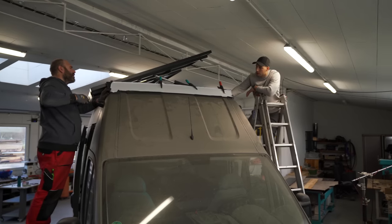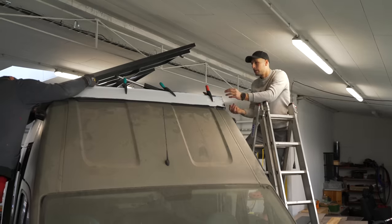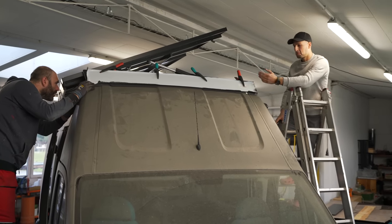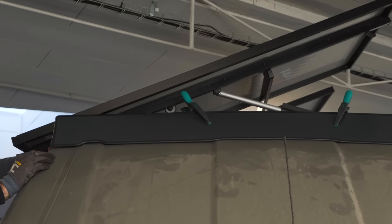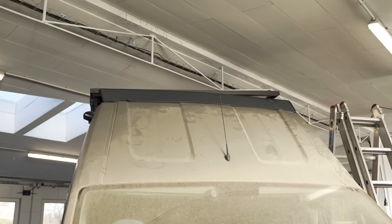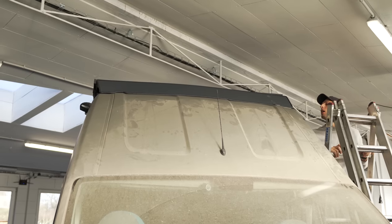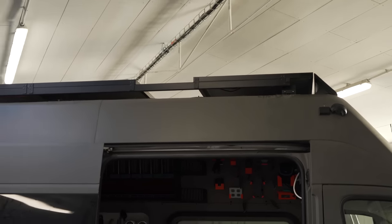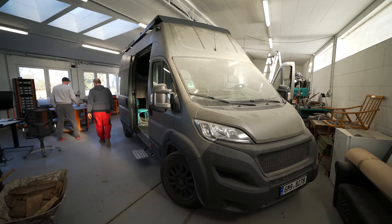Safety first! This is not that difficult to glue — we have these 3D printed brackets. We're gonna glue them, clamp them to this deflector first, then just apply the glue from the bottom on all of these brackets, sit them, measure from the solar so it's even, put a bit of weight on them so they don't slide down on the glue, and that's it. We ended up with aluminum sheet and 3D printed brackets. Brackets are printed from ASA, so that's water and UV resistant. We're using carbon glue and that should do the job — it only deflects wind. You can notice there is a gap between the deflector and the solar because the whole solar frame lifts up to 47 degrees and we need some tolerances.